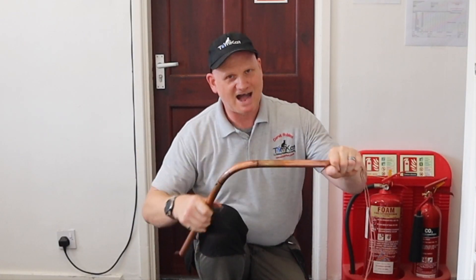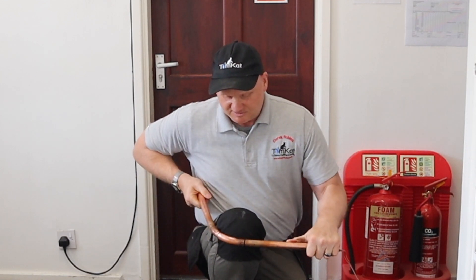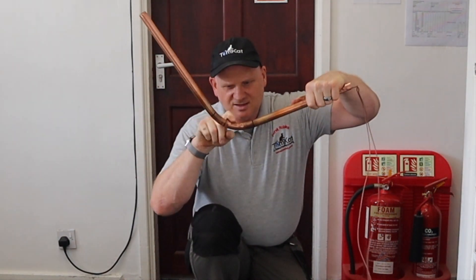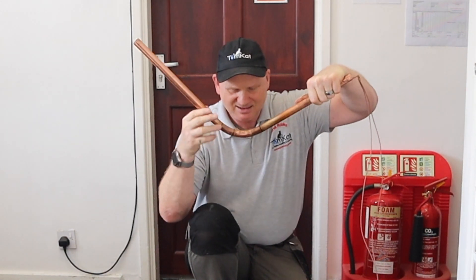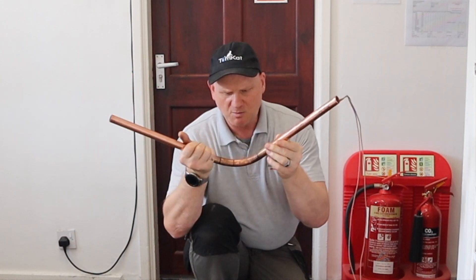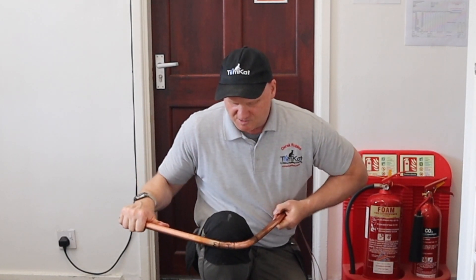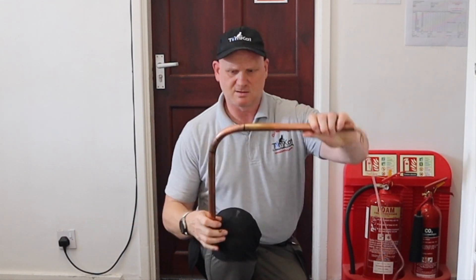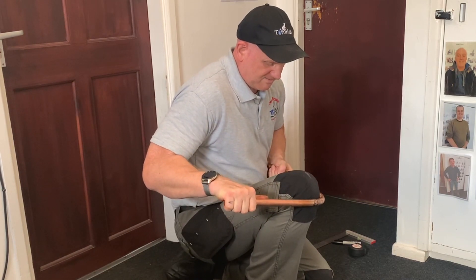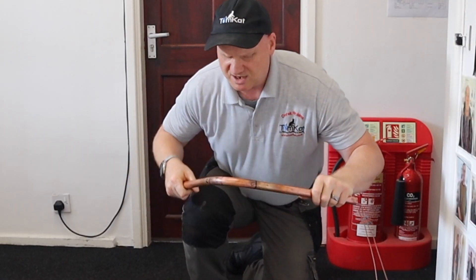This is a lot harder to do than 15mm, obviously. That cracking is the spring, not my shoulders. You can see it is starting to ripple quite badly — you can see where the spring has opened up massively. If I had a decent spring this would have worked perfectly. Now we are getting there and you can see we are starting to form the 90 degree bend.